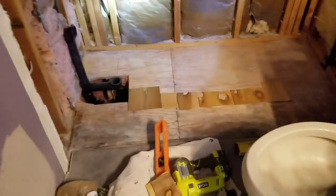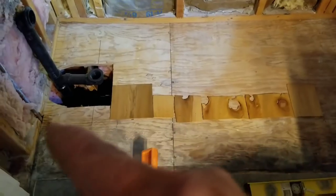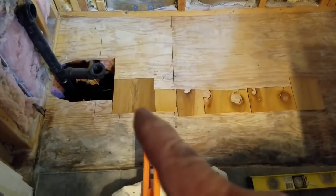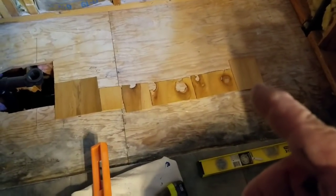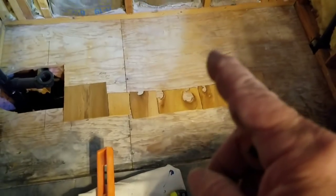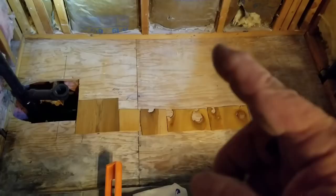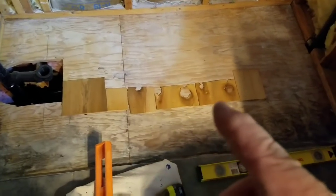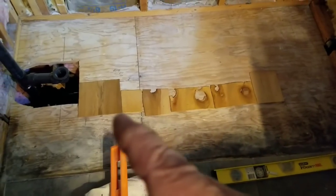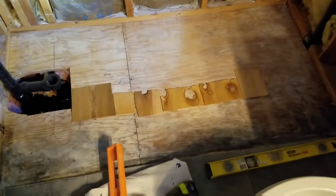You can see I've got solid shims on the ground. That line is 10 inches in, and I've got 13 inches until the drain starts. From there to the drain, all the way back at 36 inches — that's 36 inches long and 10 inches from this edge. This one is already perfectly level. I checked the level this way — it was all level. Then I checked it this direction and it was off about an eighth of an inch. So I put the shims in at an eighth inch — I cut them down to an eighth inch thick, all the way across. Then staple them all in super tight. Now that leg and the next leg will both be sitting on solid shimming, so that's how you do it — it'll be absolutely perfect.